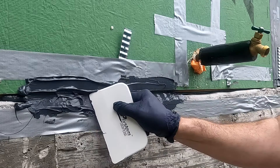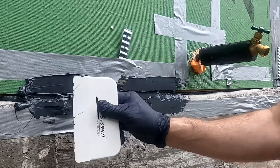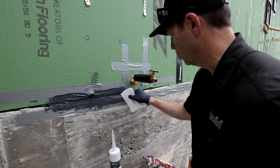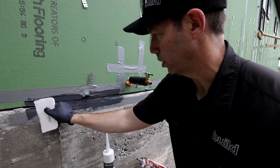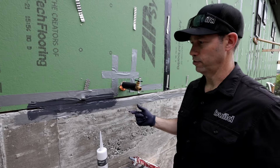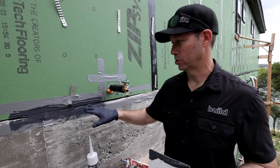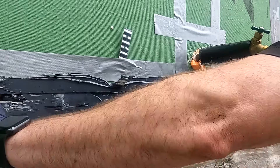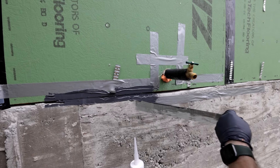If your sheathing was proud of the foundation, we'd have to get up underneath and really seal the edge of that OSB or plywood. But in this case it's flush, which makes it a little bit easier. If you have a bigger gap — like this hole at a plumbing penetration — put a backer in there first; canned spray foam works real well. Let that dry, cut it back flush, then liquid flash over it. We're going to go around the entire foundation. When dry, it's like a rubberized coating — feels like bed liner — and it sticks tenaciously to both the concrete and the Zip sheathing. Then while it's still wet, just peel off your tape and you've got a nice tight joint.